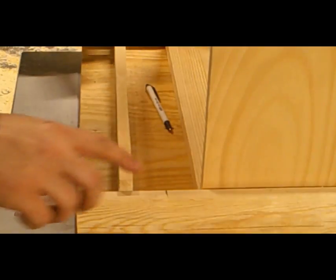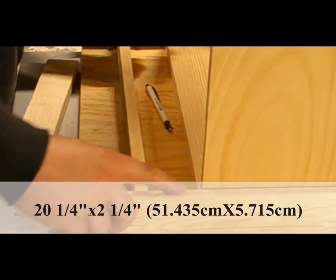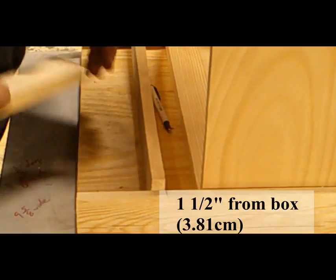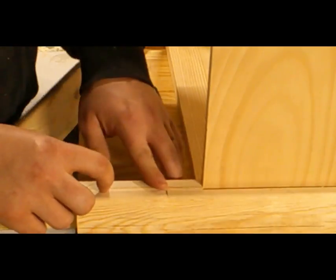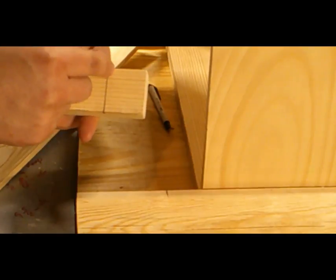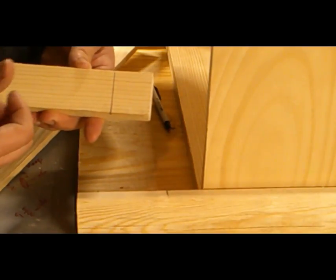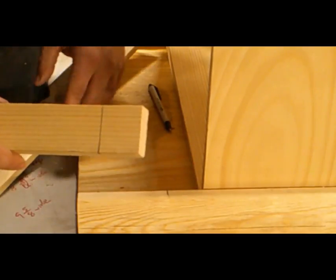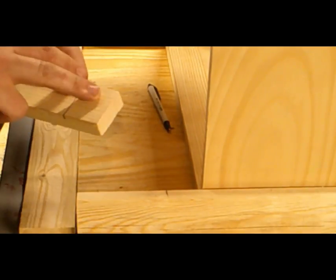Now what I've done here — I went ahead and cut a board to fit from this part to the other part and made my mark where I want it to be, because eventually I'm going to be stapling this in place. This piece here is going to go right here, but I need to cut a curvature in it. I'm probably going to kind of freehand it, then cut it out on the band saw, and then go over to a sander and smooth it up. I've got a belt sander so that's what I'm going to use. Let's go ahead and freehand this curve and go over to the band saw.